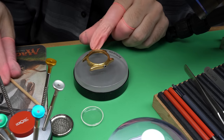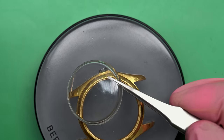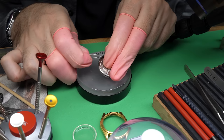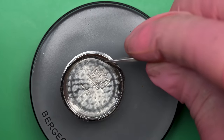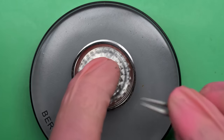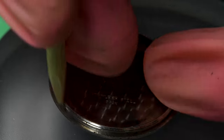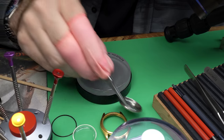Let's take out the crystal. It's got a little bit of damage on it and I think it's just going to need to be replaced. I could technically try to take the buffing wheel to it, but there's no real point. You can see the Tudor logo on the inside of the case back. There's quite an old, dried-on gasket here, but it looks like it's going to come away freely. Sometimes they get adhered to the inside of the case, but not this time. That will need to be replaced as it's going to lose its ability to remain watertight over time.